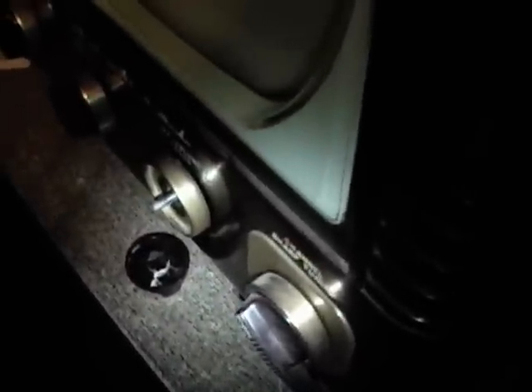What they did is put in a control that has a power switch and volume control, but the focus control is no longer there — this knob isn't really doing anything. They drilled a hole in the back of the set and stuck a separate focus control back there. Also, the shaft for the volume control is all wrong — this one has a split shaft, but it should be a half-moon shaft like on this one. I want to slide this out, remove that new control, put this original one in, and wire it all properly so both controls work and the knob fits better.